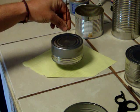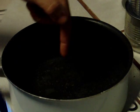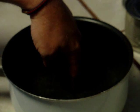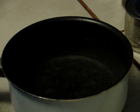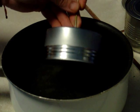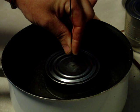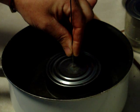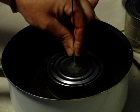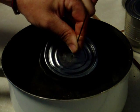We're going to do the displacer leak test now to show you how to do that. This water here is hot but not so hot I can't stick my hand in it — you can make it hotter if you want, but I don't want bubbles popping up from boiling under the bottom. So we stick it inside. Do you see any air bubbles coming up other than ones I disturbed off the bottom? If I move around like this you'll see a few come up — that's stuff stuck to the pan. But no leaks; we've given it time to heat up in there.